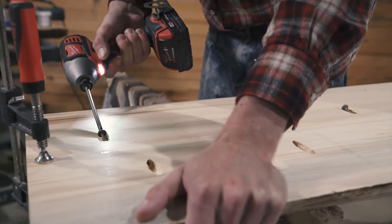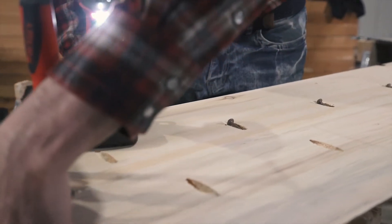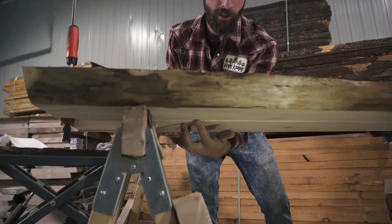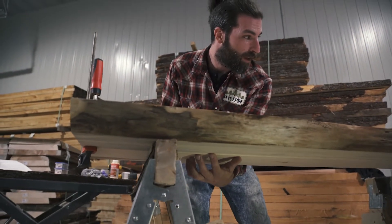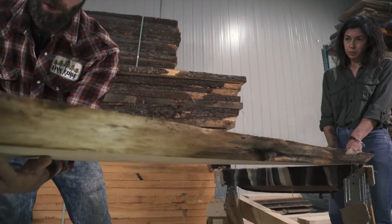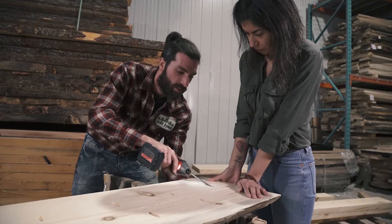So now I'm ready to put in my first screw. Now that we're at our second screw, I'm going to feel underneath the board to feel for the height difference. Right now I feel that the board with the screws is lower than the other, so I'm going to ask my friend to lift that board up. Keep going — right there. I can feel that it's flush. Perfect.